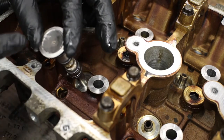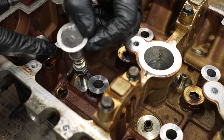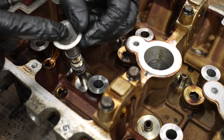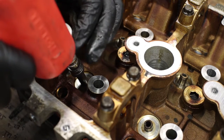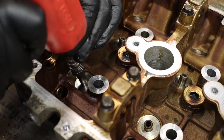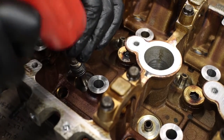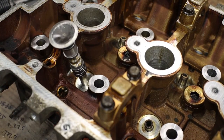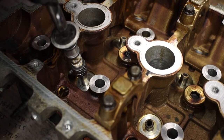You can see why I had to space that — this is going to hit right here at the cam bearing journal in the corner. That's why I have it spaced so much. We're going to start it with a hammer; fortunately it goes in pretty easy. Okay, that gets it straight — now we can carefully send it home.